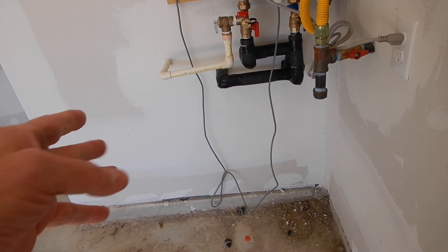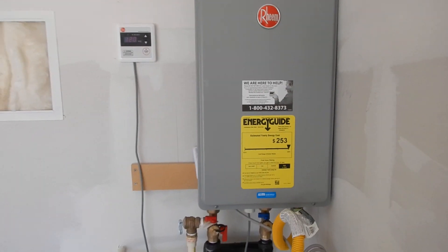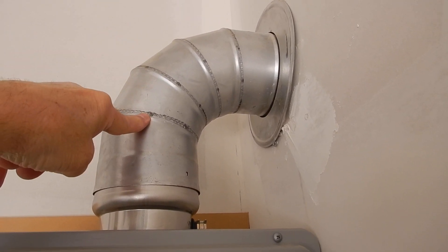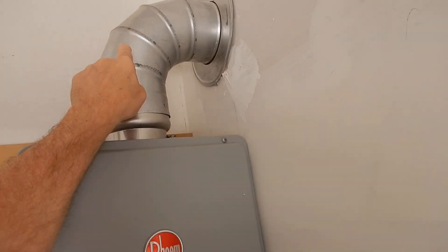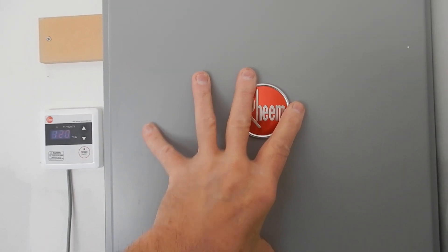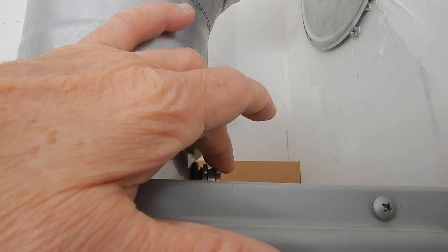You know why you need that safety pan? Not just for this. See that little nozzle right there? It has a purpose. This is a high efficiency water heater — it extracts all the heat out of the gas and puts it into the water instead of the air. The condensate comes down here and goes out this drain. But you don't have a drain. If you don't have a drain, where does the condensate go? It goes down onto your heat exchanger, comes inside, and corrodes the whole thing. Read the instructions — you need a sediment trap right there, and a condensate drain.